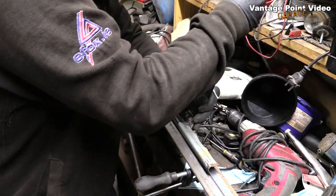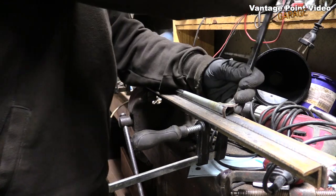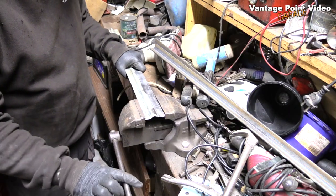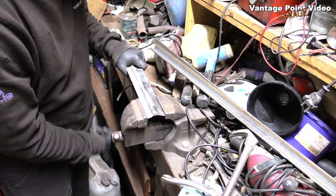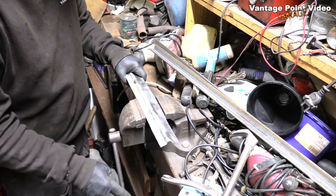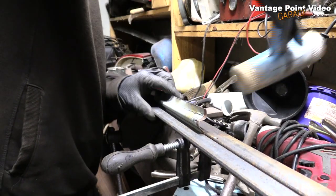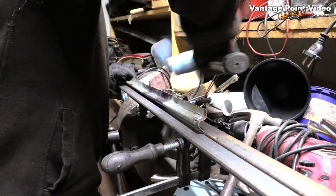Once I'd gone all the way along, I was able to push it down closer to the actual line where the fold would be, and prized it up again. A bit messy at first, but then clamped it again over its full length and got those edges straight, and now I'm just pressing it to pop up that center ridge again. Did that the whole way along, and now I had plenty of space to make the full fold.